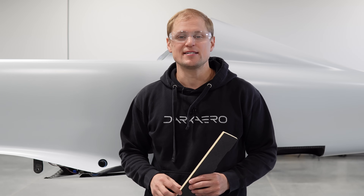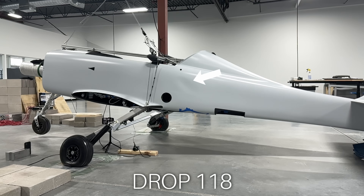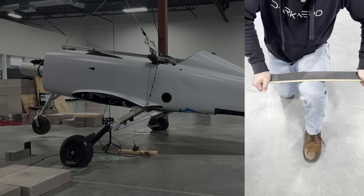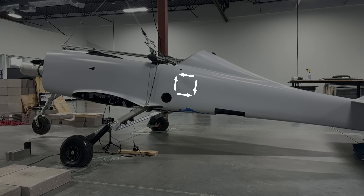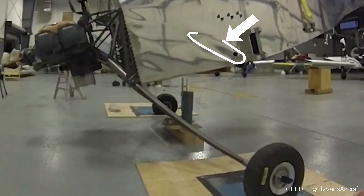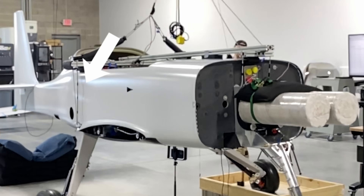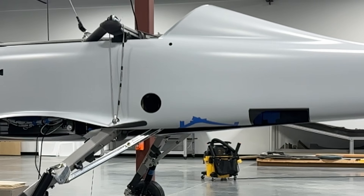Here's another modification that came about in drop testing, this one on the airframe. This is drop 118 again but from a different angle, and I want to highlight the diaphragm action going on in the fuselage side skin just behind the cabin. During the impact event the fuselage essentially tries to bend — think about bending a board over your knee. The fuselage bends the same way over the main gear, with the top in tension, the bottom in compression, and the sides in shear. The fuselage side skins are pretty thin, so in shear they can deform with 45-degree ripples, which is specifically shear buckling. Other aircraft show this too — riveted aluminum airplanes have thin skins so they can get shear buckling during landing impacts. This isn't much of an issue at the magnitude shown here because the skins just spring back into their original shape.